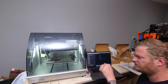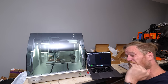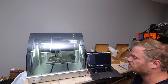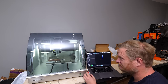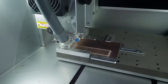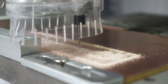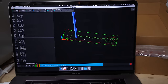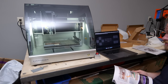So this is probing the top of the circuit board, the PCB, so that it doesn't have to be completely flat — it can have a little bit of variation and the machine will adjust accordingly. Now we're switching to the V-bit. We apply the UV solder mask. We're going to have to vacuum up some of this dust.